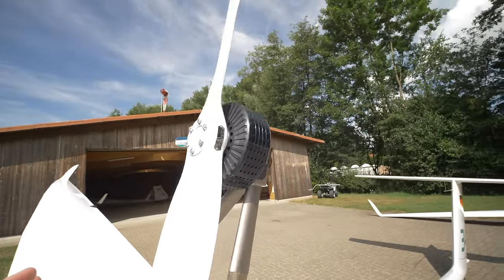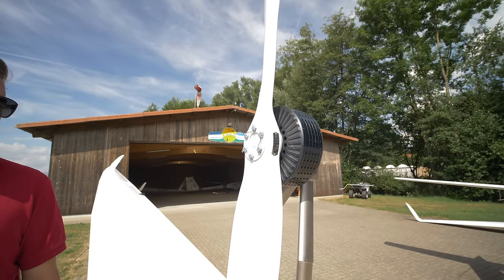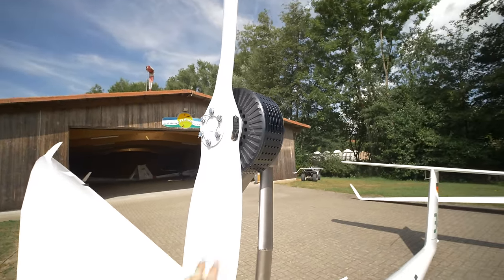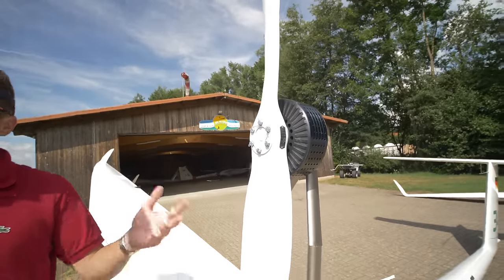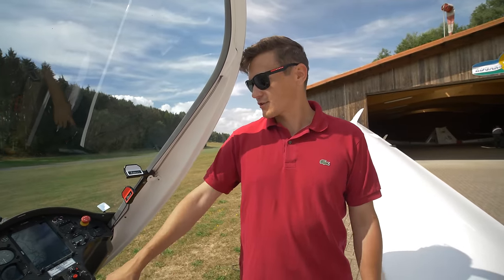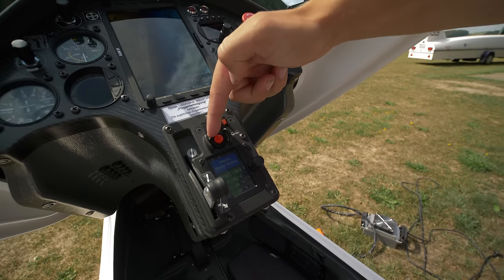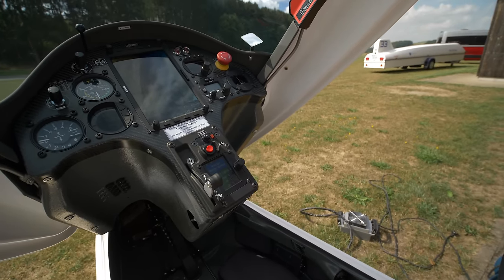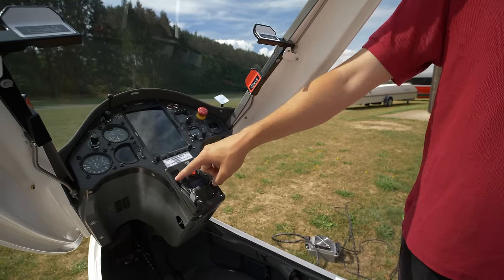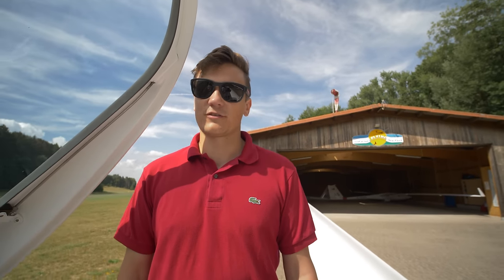What's the sound here? The power unit is putting all the energy into the whole system, holding the propeller in the zero position going in or going out so it won't get damaged in the storage compartment and won't windmill in flight. Once extracted, you get a notification that you can press the starter button — the red button. Pressing it frees the propeller, and then you can control the power level with the lever up to full power or half power. The propeller turns and you can freely start your self-launch.